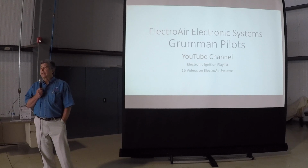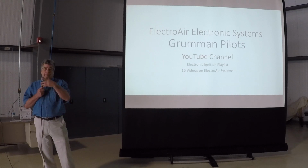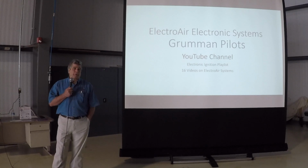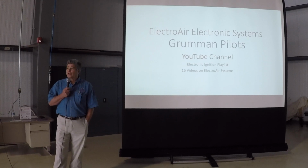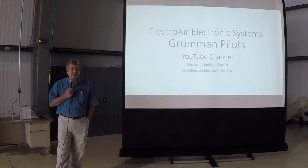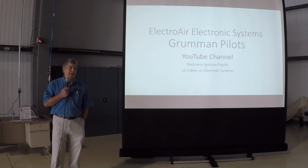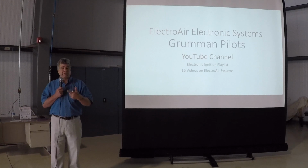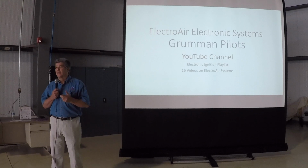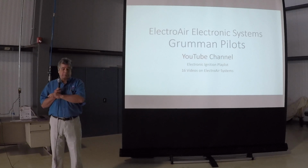So you start looking at, we're just going to say that fuel's $5 a gallon nationwide. If you're saving a gallon an hour in an O-360, like in a 172, and you don't have the mag inspections, let's say the unit costs $5,000 to install. Well, by the time you've operated the unit for 1,000 hours, it's paid for itself, and then everything after that will be gravy. Larger systems like the 6-cylinders that are saving 2 gallons an hour will recoup your money faster. Plus, your plugs won't be loaded up. We had a customer come in with 150 hours of flying last year, and when we pulled the ignition, all the plugs in the airplane were completely clean.